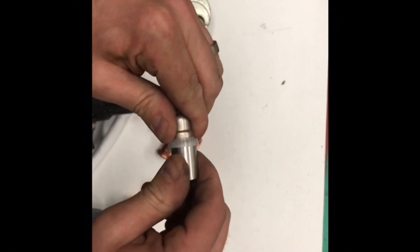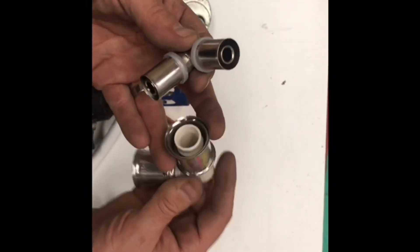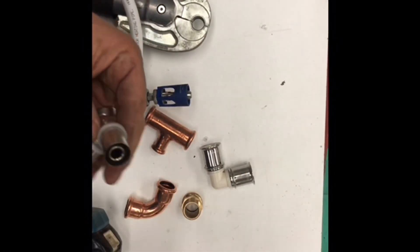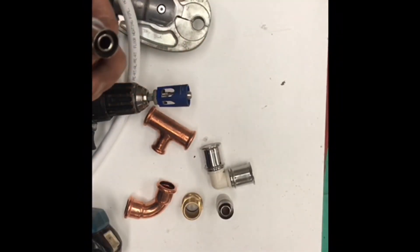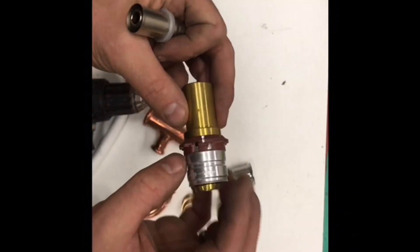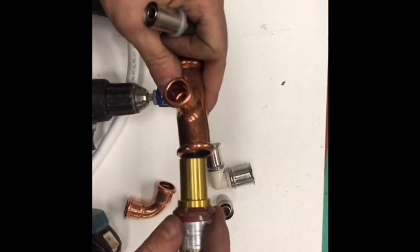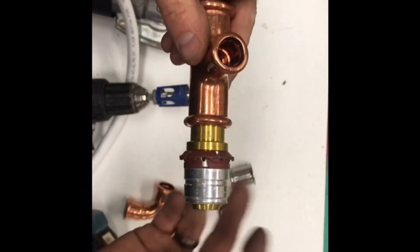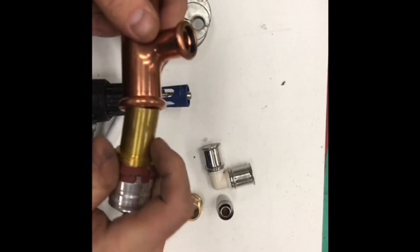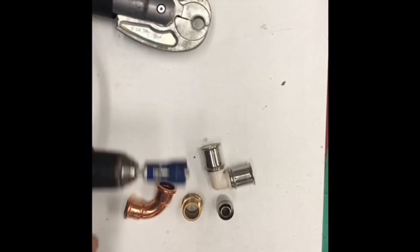This is your fitting. These are an older metal one — this happens to be a Rifeng one. That's a Multikwik one — it's plastic, composite, double O-ring sealed. Different sizes: there's a 20mm one, another Rifeng one. These are Uponor fittings. That's a spigot — 25mm to 22mm — for press fitting, to convert from copper. You can put compression or press fit; you can't solder these. It's got two O-rings in it.